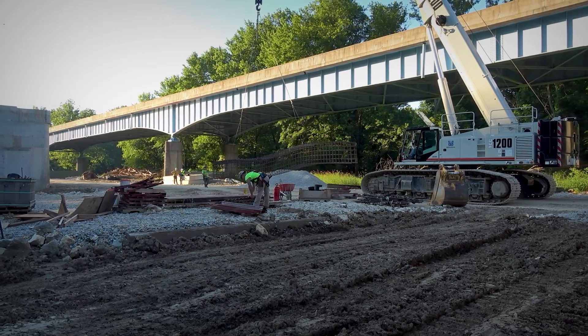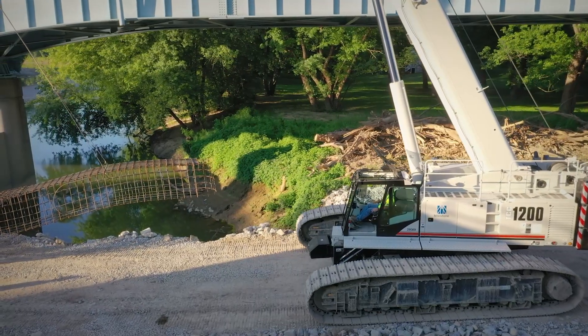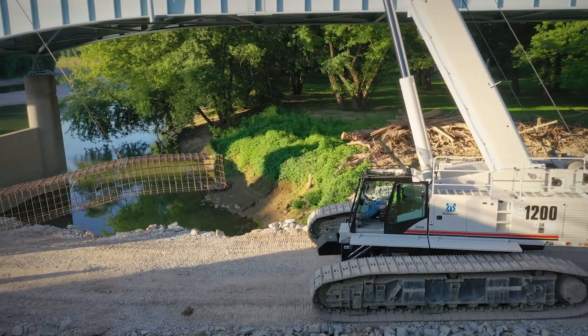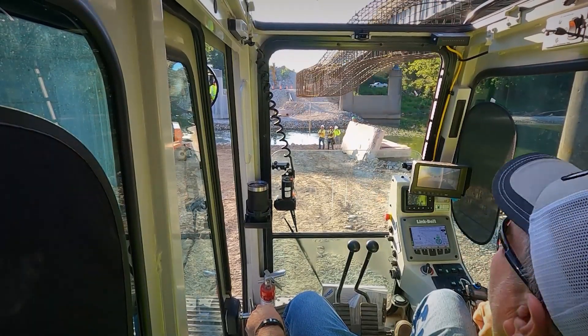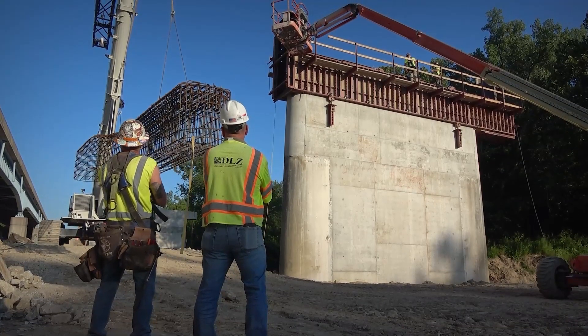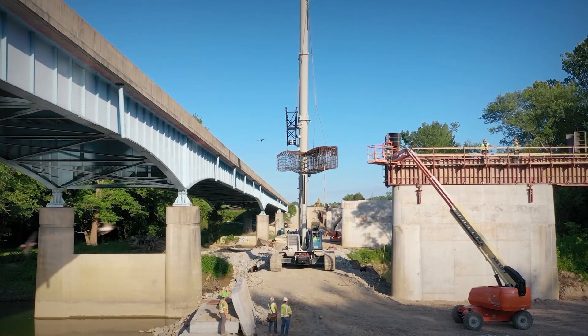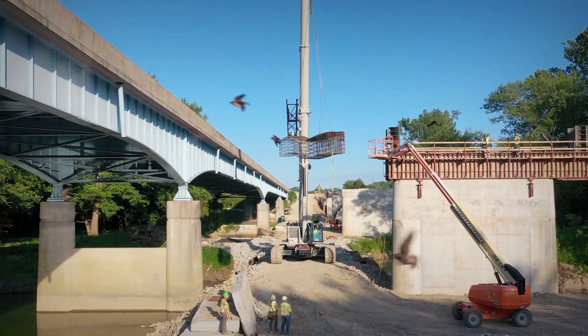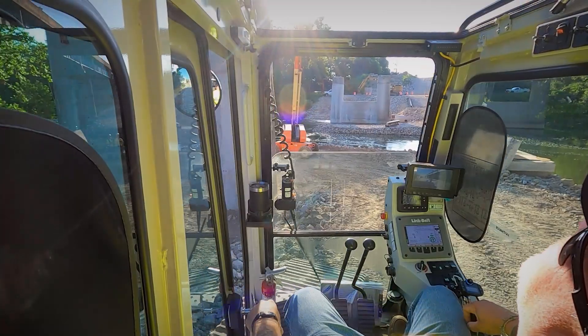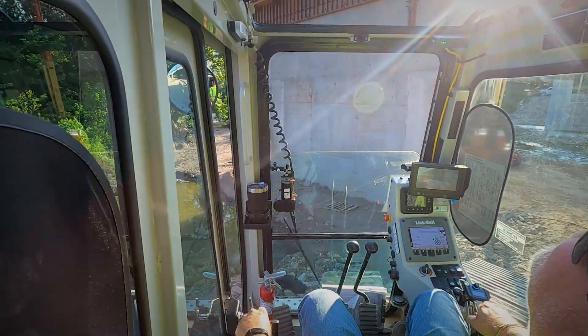When we're driving piling, a lot of times you can't see that hammer and there's a starter that you've got to pull up on there. So if the sun's in your eyes or smoke off the hammer, I can use the winches so when I cable up you can feel it jump, then I can watch that cable back there. I can cable down and just as soon as you see just a little bit of slack in it you can stop. Keeps you from birdcaging your winches back there.